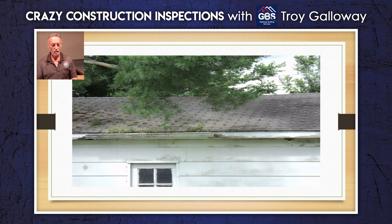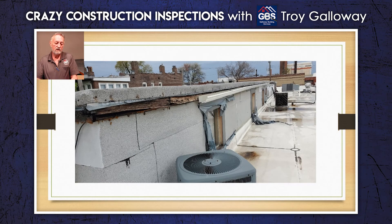You didn't think that you even needed any more than that? And here you go — this is a commercial building and a restaurant here in town. I was up on the roof, take a look at this. What are we doing? I guess we just didn't feel like we only needed gutter on the whole roof — we only needed it just for this small section here. Of course, this wood is so rotted here, I don't know how it would hold anything anyway. That water just runs off here, runs down here, runs into my windows — and I wonder why I got moisture problems.